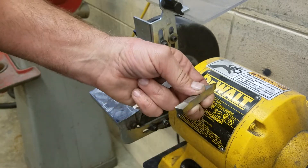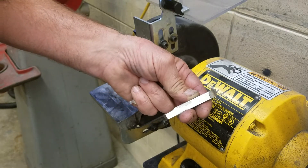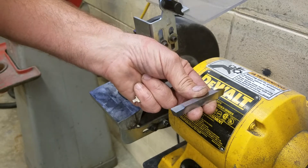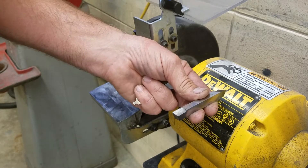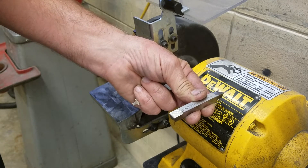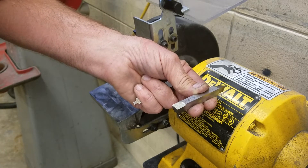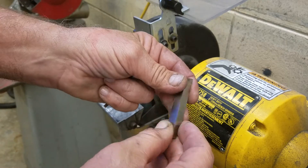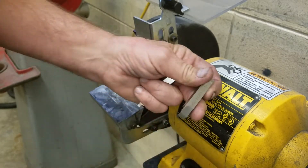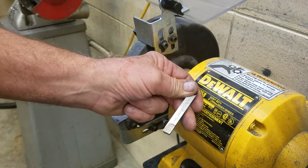There's no cobalt or anything in those to make them really resistant to high heat. But they do make a 5% cobalt, an 8%, 10%. They make a T15 which is about the best — they're $36 a piece. The M43s and M42s are really good, but this is just a typical M2 right here — it's a high-speed bit. When we get into the higher cobalt and tool steels like the T15 or the M43, the price really goes up.